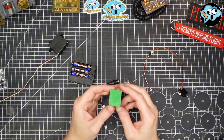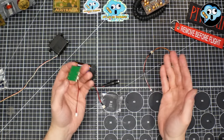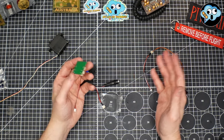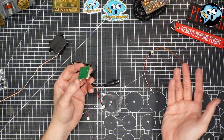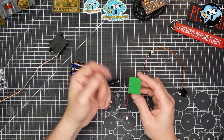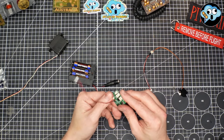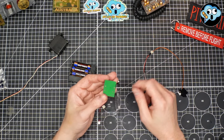And if you see blobs touching on the circuit board, if you have the skill to desolder and resolder or remove solder or whatever, you can do so and maybe just save yourself the time of contacting customer service for a replacement circuit board. I actually had this happen on my Fan Home Enterprise, and it was a simple fix. I just had to take a little solder out. There was a blob that was touching. Sometimes it's as simple as just snipping off some excess with your nippers.